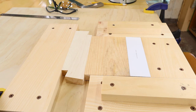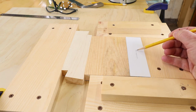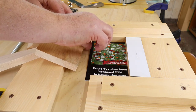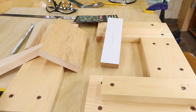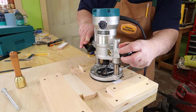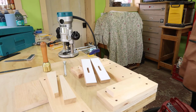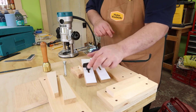Let's focus on the sliding rails. The rails need a groove cut through them. To make the groove, I put together a very simple jig made out of some scrap pine and a bit of plywood in the base. The jig uses a compression fit via a couple of wedges. I'm using a piece of paper to make the area where my router base sits level, or just slightly proud of the slide rail. With the router in place, I can move it between two stop blocks and use the router fence against the jig to keep the line nice and straight. Take a few plunge passes to get all the way through the slide rail, and in the end you'll have two slide rails with a slot. We can try one of the T-handles in the slots to test the fit — the fit is good.